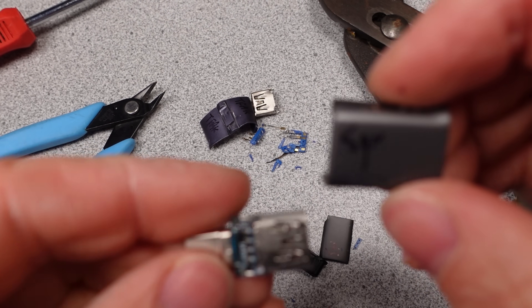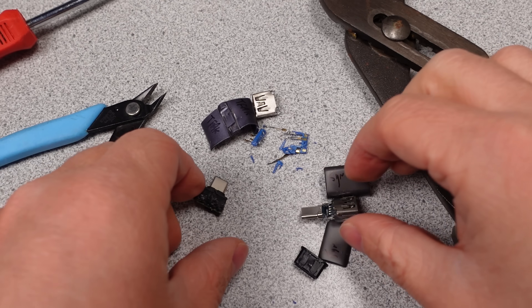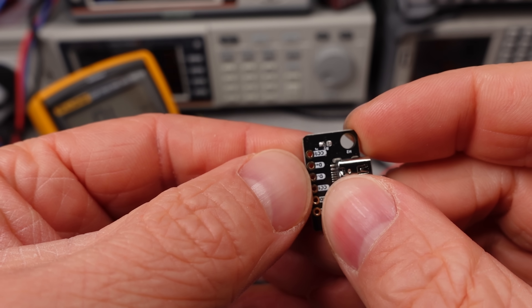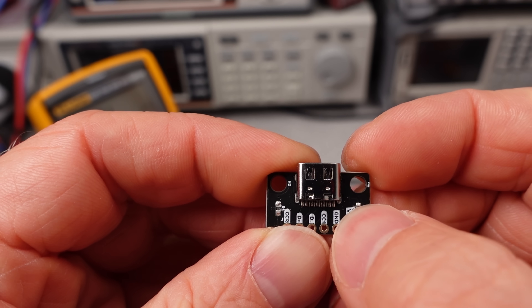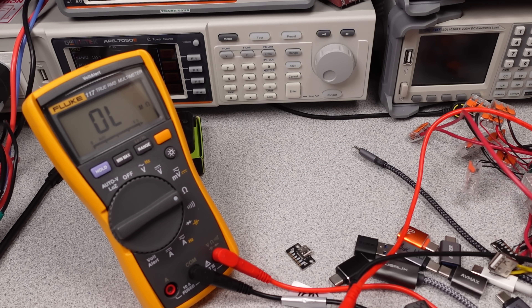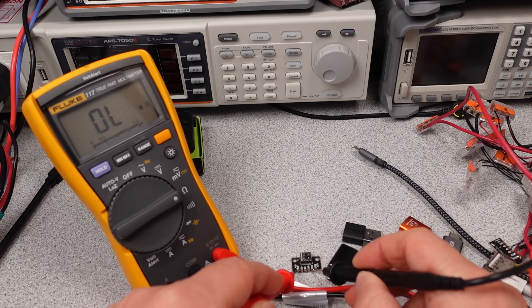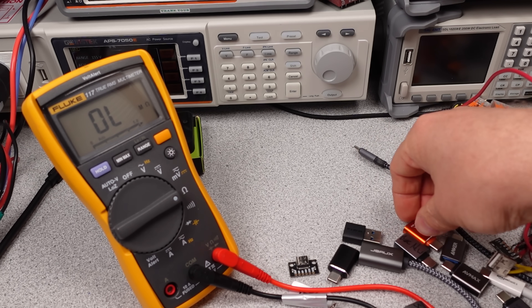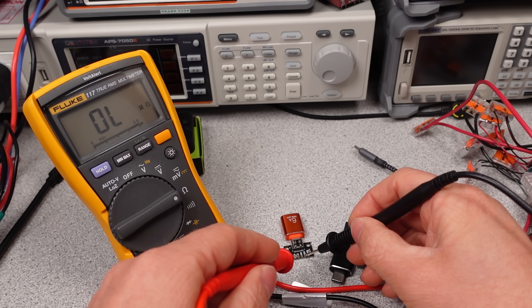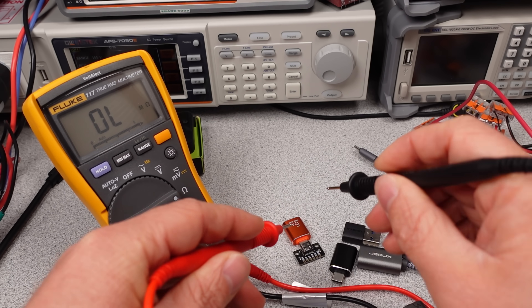Since these all apparently just have a resistor in them, it's probably easiest to just measure it and see if that's the case for all of them. I have a USB-C connector mounted on a circuit board that breaks out the CC pins — these are the pins that communicate for power delivery from your power adapter to your device and vice versa. The resistor value, which you can look up online — linked to the DigiKey forum in the description — determines the current limit. All of these chose the 3 amp limit, or in this case a 5.1 kilo-ohm resistor. They're all exactly the same, except for the other Ugreen adapter which is the opposite polarity. This means that these all use simple or legacy mode to ask for 5 volts and 3 amps from the USB power delivery device or protocol chip. This is okay, but it does rely on certain other things being done correctly. The fact that these use a fixed resistor value is also another limitation and potentially a hazard.